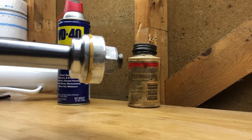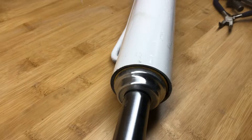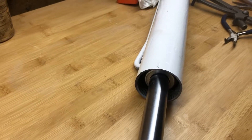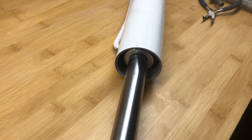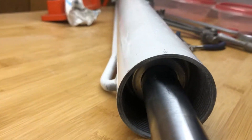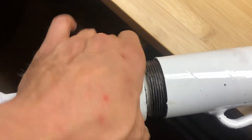They do recommend using some sort of installation sleeve for the piston, but you can get it in there by just rotating it slowly — not really rotating, but moving it around. It will cause the o-ring or Teflon seal to shorten up and slide into the cylinder. As you can see, it's made its way past the threads and into the cylinder. Once you get it to this point, pull the head up against it and slowly rotate — it should draw itself in.